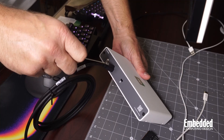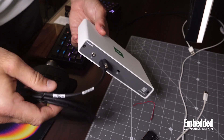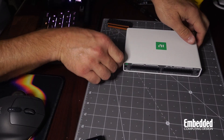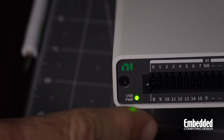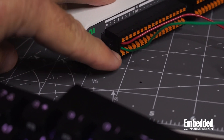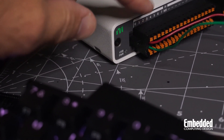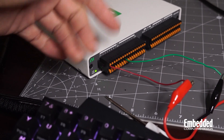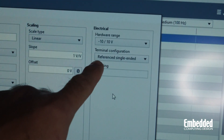After much setup and logging on, I'm finally able to take on a project. I'm not seeing my hardware — it's not plugged in, so I need to go ahead and do that using the convenient thumb screw. I've got it working now; it's taking readings and properly hooked up. The power button is happily blinking away. I've got my device set to take differential measurements between the positive and the ground on the bottom — those are the differential pairs for input A0. I've got that running off an external voltage supply. You can also set things up as single-ended, but you'll have to switch that in software.